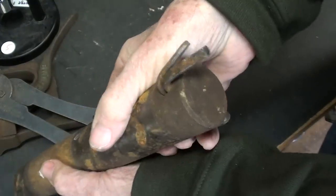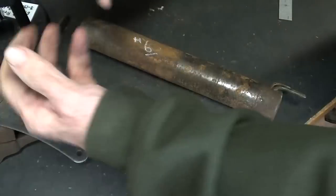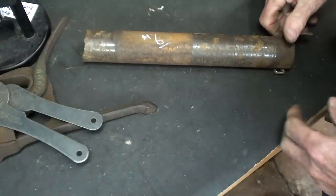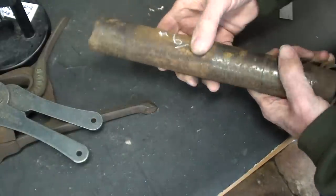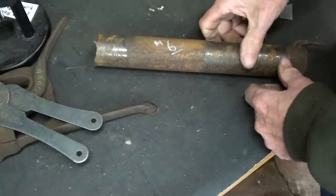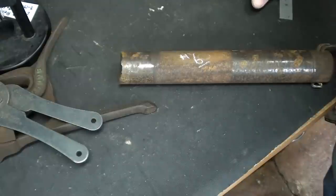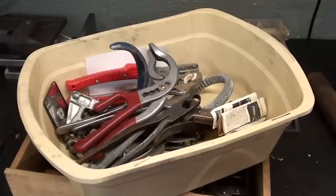Number six, and this was the bonus. This is a pin that's been sheared from a railroad car coupler — that is the pin that holds the knuckle where they go together. This came from a grain elevator that has a rail loop a mile long where they load rail cars with corn and beans here in the Illinois Valley. That train stops and starts 50 times as they load the cars. A man that works there gave this to a friend of mine, and he said they're all over the place laying between the tracks. When the slack is taken up, there's quite a force on the couplers, and the train gets heavier and heavier as it's loaded. Apparently these break all the time, and that causes the train to separate.